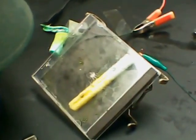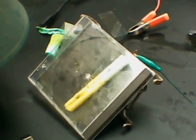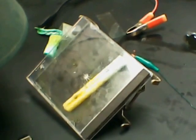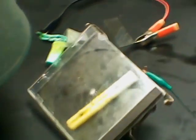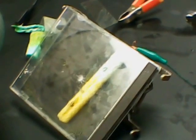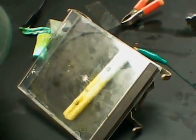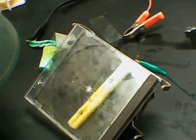Among other things, I've been working on developing biochemical ionic liquids that will dissolve oxides like copper oxide and cuprous oxide, a venerable P-type semiconductor. I've developed a prototype — it's a variation of the Grätzel solar cell, where he uses titanium dioxide, an iodine salt bridge, and a sensitizer, usually a dye.